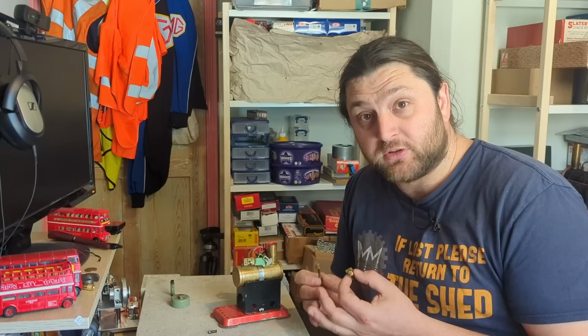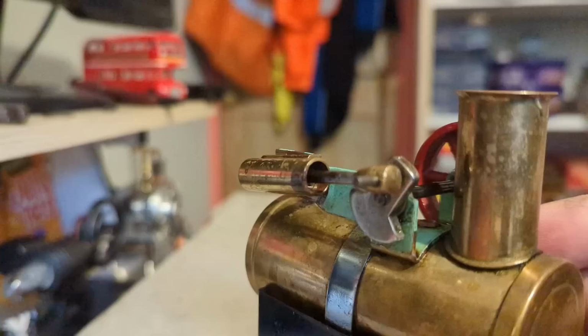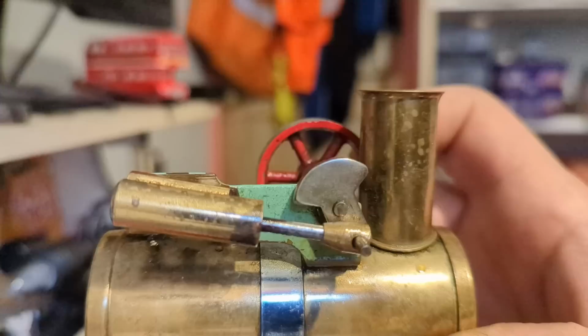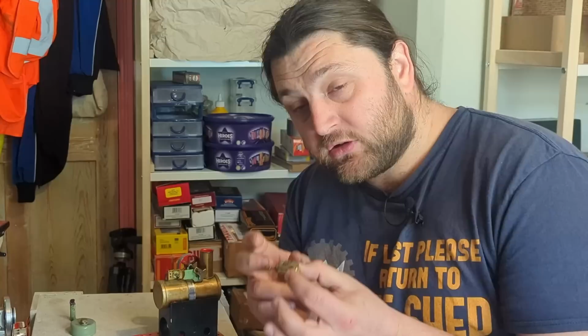So that means that going up here into this cylinder where there is low pressure is where the steam wants to go, expanding it. And as the piston moves into the other position, which is up, the steam will then want to escape out of there. This is helped by the fact that as this comes around, the momentum of the flywheel forces that cylinder back in. The thing to note from this is a cylinder like this only works on a single stroke.